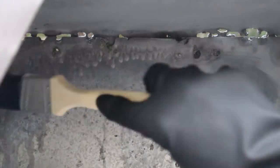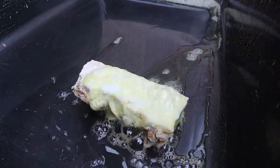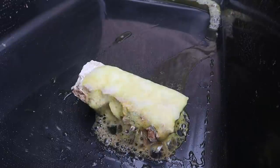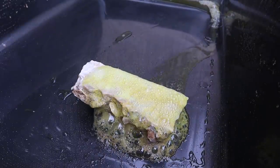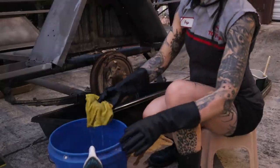It's very invasive. Okay. But it will get to concrete. Like I said, it'll leave it like brand new concrete. If you leave it on there longer in your shop floor or whatever, it'll put a little hole in it. It'll eat through. Okay. Wear rubber gloves. Like chemical style gloves. Yeah. Outdoors, you'll be fine. Whatever you have left over, neutralize it, pH level good, then you can get rid of it.